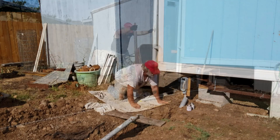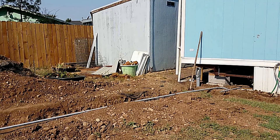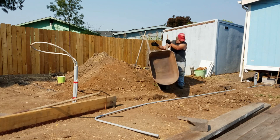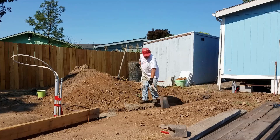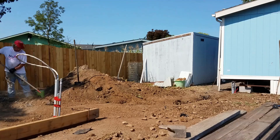In this freeze frame you can see a three-quarter-inch diameter conduit — that's a chase in case I need to pull more wire in the future. I also put another three-quarter-inch conduit in for internet cable. I filled the trench with sand and then laid warning tape so someone in the future knows there are buried electrical lines. Then I started backfilling with dirt, getting rid of large rocks in the process. This area is partly going to be gravel driveway and partly lawn, so I might as well get rid of the big rocks while I can.